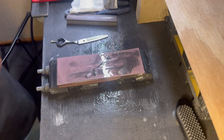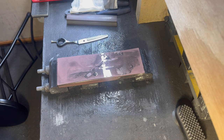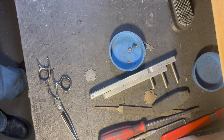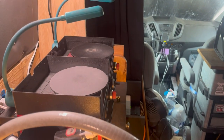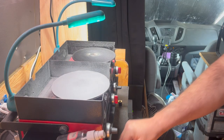I'm going to stop completely before I come off the stone — you always want to stop completely before you come off the stone. Now we have a new ride line created. I'm going to sharpen and dull this because there's a touch of damage on this blade as well, which I don't think was the fault of whoever sharpened it — more than likely it was because the teeth were not making contact properly.